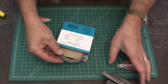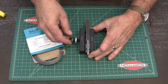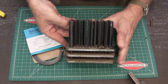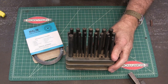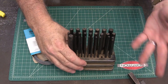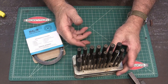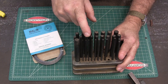That's the wire right there, and so you feed that up through there and then you wrap it around a mandrel. Now this is what I normally use for mandrels — they're center punches. You find the diameter that fits in the hole, then you smack it and it gives you a center point inside that hole. That's what I usually use for mandrels. I rarely do a spring that has to be an exact size, and you can also use the shanks of drill bits and things like that.